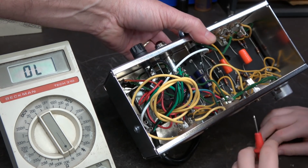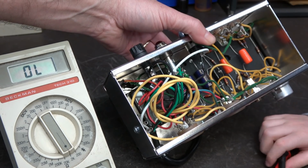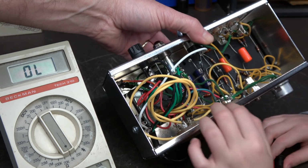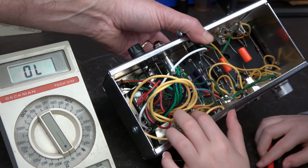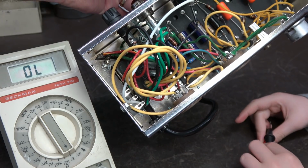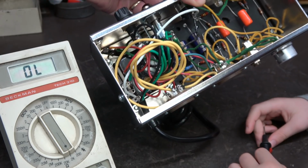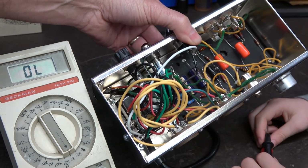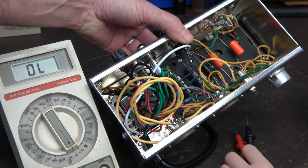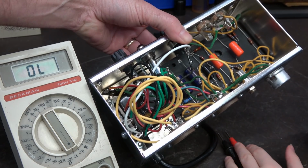Tell me what you see. Red, yellow. I wanted to show you that one of these, and there was one more that I saw right there. Oh, I saw those black marks. Oh, good eye. You're right. There are some little arky sparky marks. So that could have been caused from a soldering iron, maybe, overheating the wire, or somebody could have accidentally had a probe in there. Oops, let's not knock the camera over. And caused an arc and burnt the wire, okay?